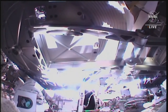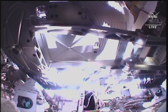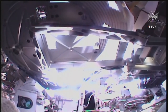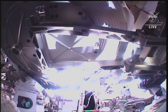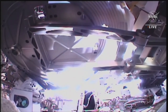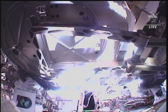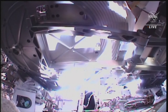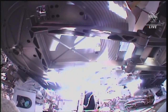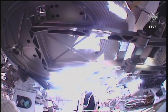Okay. And now control of the iROSA from my position. Copy. And you might have said it, but to confirm, your heels are secure and the APFR and your gauntlets are down. Gauntlets are down. My heels are secure and eyes on them. Okay, copy. So now you're going to work together to release iROSA. Thomas, when you are ready, you can give Shane a go to release the final FSE bolt, Charlie 11. I'll have settings for that in a moment, Shane. But a caution, prior to releasing iROSA, ensure that the FSE is not moving. And Thomas, you will keep iROSA pulled toward you to keep it engaged on the pin slot interface on the FSE until you are ready to release it. Following that final bolt release, Shane, you'll be installing the square scoop 45 degrees toward Thomas and then translating to clear iROSA from the tower grapple fixture.